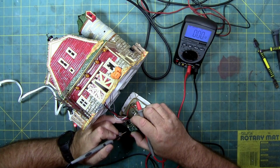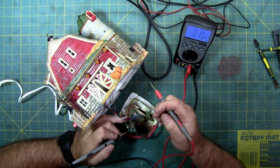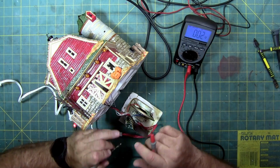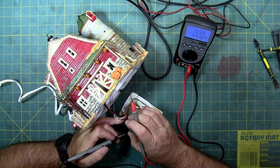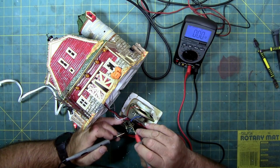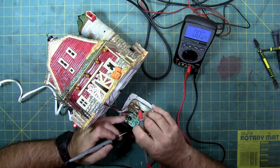I'm going to say that was their cause, because this is starting to liquefy just from having it running right now. It's getting sticky, so that means the blob chip's getting hot. So there's still connection, which I know there is because the power is going to it. But I'm going to say the problem is the blob chip is bad due to the fact it probably got overpowered because that transformer is out of whack. It's too high of a percentage. But let's test the power at the blob chip.